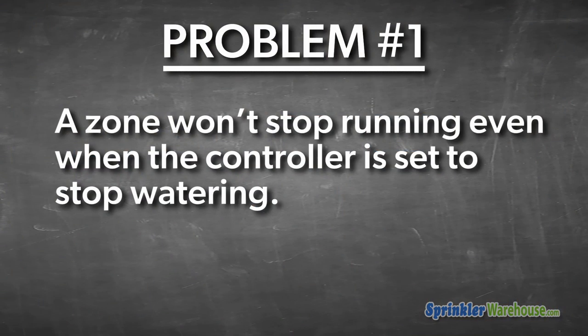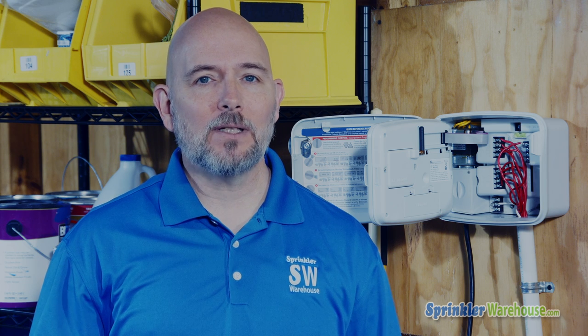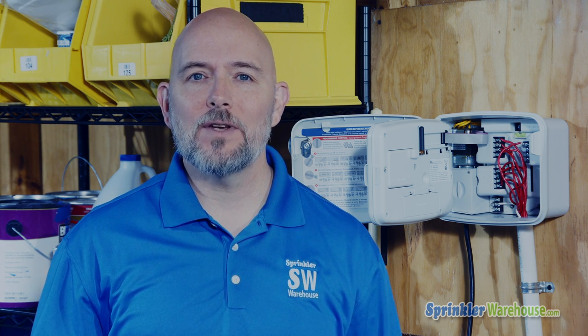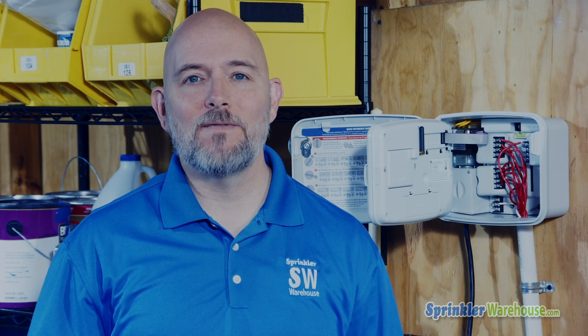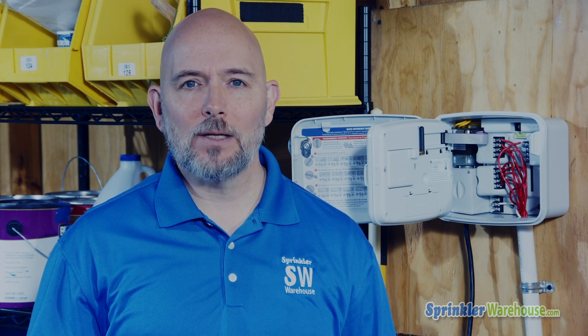So let's start troubleshooting. Problem one, a zone won't stop running even when the controller is set to stop watering. If the watering is definitely off at the controller, then this kind of issue is something that would probably not be caused by a faulty controller. It's nearly certain that's a valve issue. Let's talk about what that looks like.